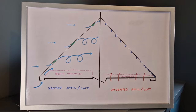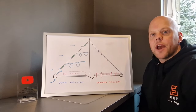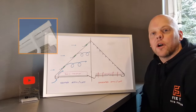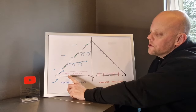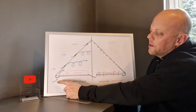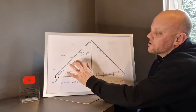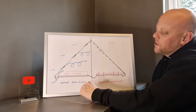The first thing you need to do is go outside and check to see if you've got vented eaves on your loft — they'll look something like this. Then go into the loft and check your loft insulation to make sure it doesn't foul the eaves. These vented eaves allow airflow to come into your loft, and that's the start of ventilating it.